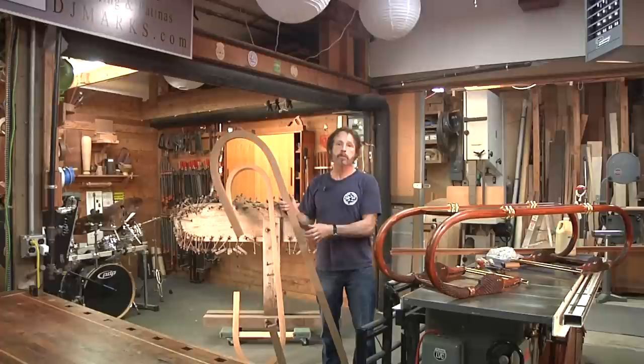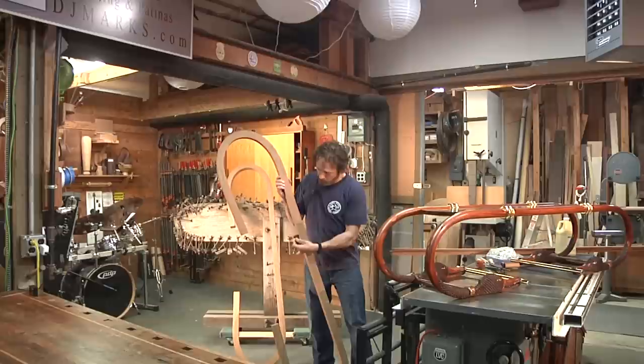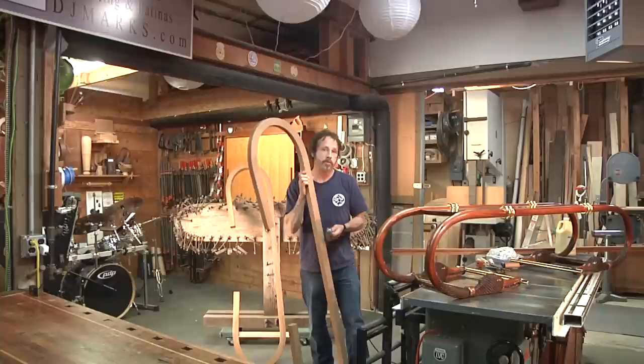Now fortunately the joinery on this was pretty straightforward. I just took a slot cutter, and that way the slot cutter, the bearing, could rest up against the stock, and then the cutters are going to spin and rotate and cut a slot into the stock. I can adjust the height of this back and forth and create a spline that's say 1/4 inch wide, or maybe it was 3/8 inch wide. And by the way, plywood works very well for a spline to attach pieces of furniture together.